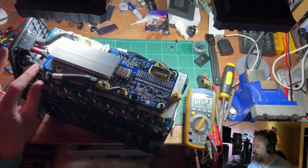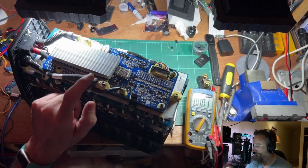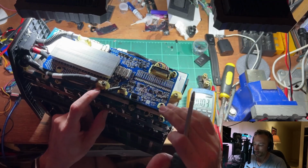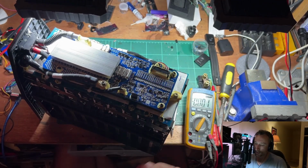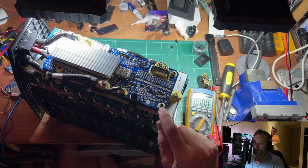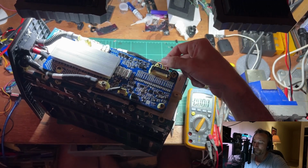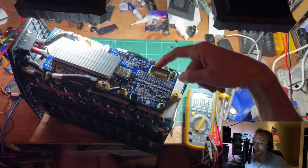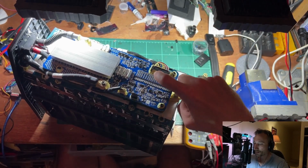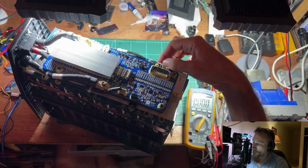They are very well insulated. Got multiple areas of insulation here. Fabric, that'd be another layer underneath, heat shrunk there. Lots of sealant, hard sealant on everything. Any component that's going to vibrate or rattle, like this little guy, even has sealant on him. Every screw has got sealant. This whole battery tap bundle is sealed in place so the plug-in socket can't come apart, as well as the pins on the backside of the socket. More fabric layer on the wire bundles.